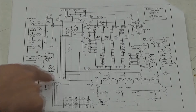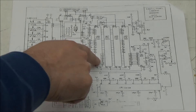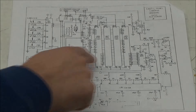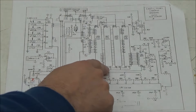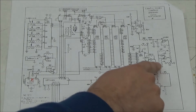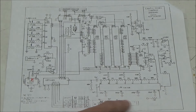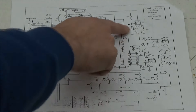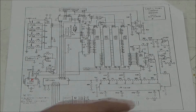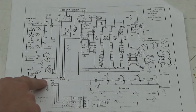The tuning pots provide a control voltage for the oscillator chip U80, which clocks two cascaded counter chips. These chips count up in binary, providing sequential addresses for the selected EEPROM chip. The highest bit used in the counter selects which of the two chips to enable the output on. For each address of the selected EEPROM, eight data bits present themselves as outputs, which are then fed into a DAC chip. So after op-amp U85, we have an audio waveform. This waveform is then filtered by a CEM3320 Curtis filter chip. A 556 timer and additional circuitry form a simple envelope connected to the control voltage input of the Curtis chip, and then the output is connected to the drum outputs through a demultiplexer.